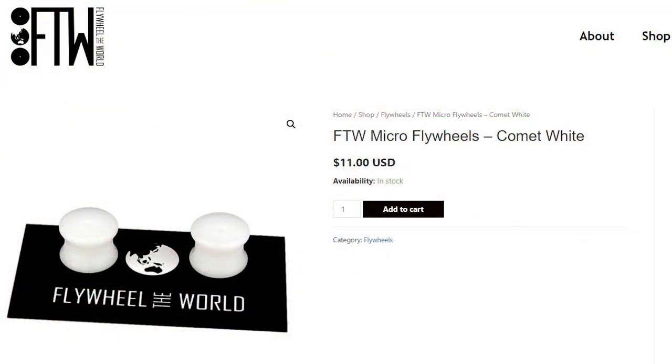This is something to consider for this build, that the price of this build drastically goes up when you start adding multiple stages in here. And I do believe you actually need to probably get a much bigger, more powerful LiPo, maybe even a 4S or something, to handle those multiple stages.